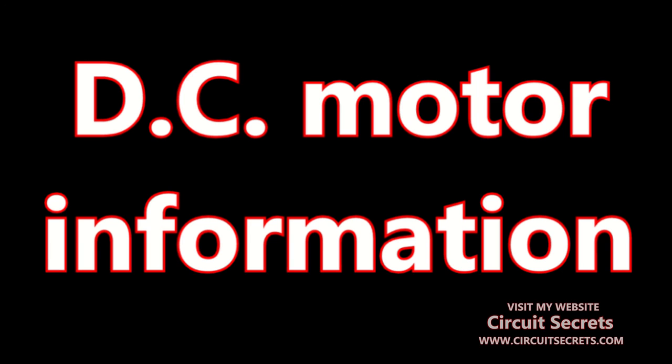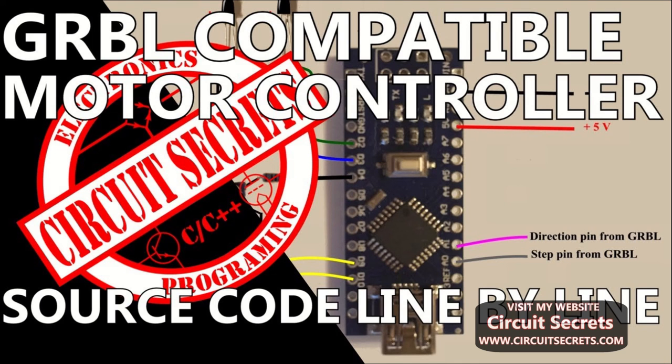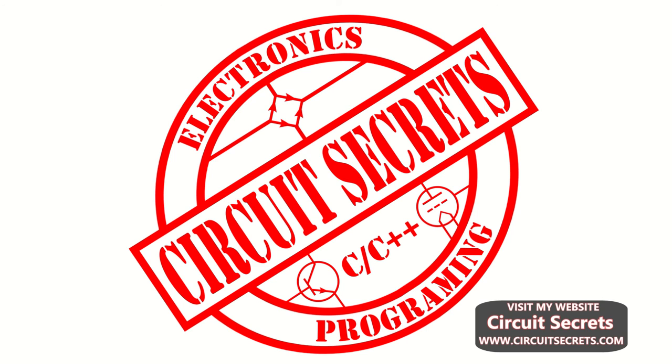The feedback system should always be reading the position of the motor, or better yet the lead screw — the key component of the drive system in most CNC machines. If the sensor tells the controller that the motor or lead screw is in the wrong position, it turns on the H-bridge and drives the motor to correct for the change, putting it back in the correct position. This system will not experience any drift unless there is a failure of the sensor to detect movement. Check out the linked videos to see more details about the DC servo motor control system.